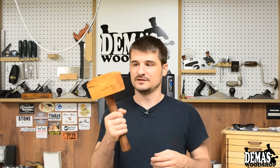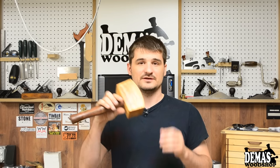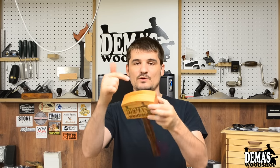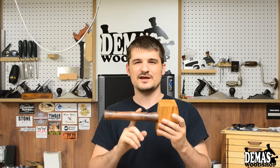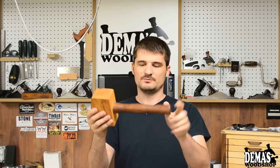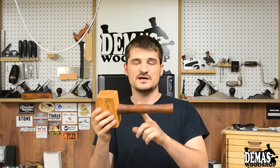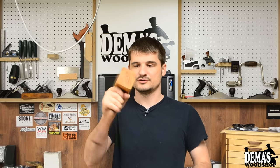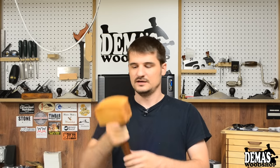The other thing I did in the last couple of weeks is I made a few joiner mallets. Now these aren't your traditional joiner mallets — the kind that have a tapered handle that wedges into the top. I really don't like those because a square handle doesn't feel comfortable to me. So I actually turn these on the lathe in a profile similar to a screwdriver handle that is really comfortable, so I can either grab it down below or choke up on top for lighter work.